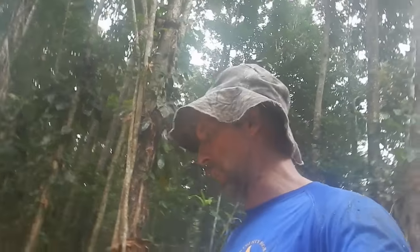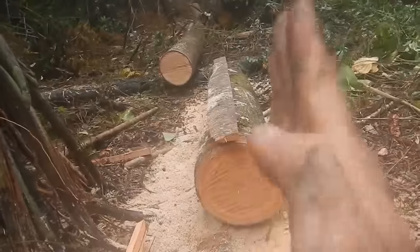And the same with floorboards. The top and bottom surface of the floorboards, they're not super important right away, but the sides where the floorboards are sitting up next to each other, I want those to be straight, so I'll cut those on the lumber mill too. And then once I get them over there, I might run them all, not the joists, but the floorboards, I might run them all through a planer, or lay them all down, then use a hand power planer to just go over the whole floor. But anyway, I'll worry about that later. Right now, I want to cut this into slabs.